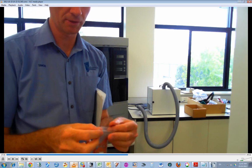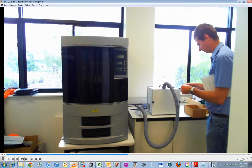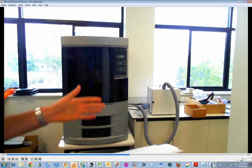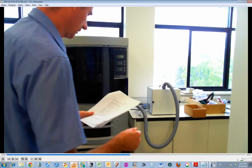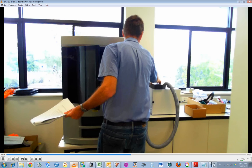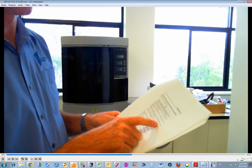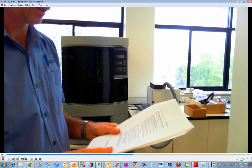Incidentally, the number of hours on the printer at the moment are around 1300 hours. So I've got to replace that. Completely powered down the Dimension, so you can see it's completely powered down. Remove the purge container, alright? Remove the purge container. What else? Remove the old flicker. Loosen flicker attachment rear screws, and pull up on the flicker. So we're going to loosen the screws and pull up on the flicker.